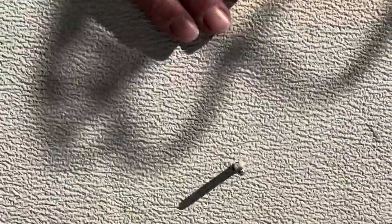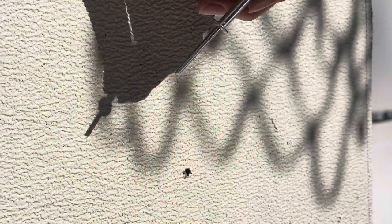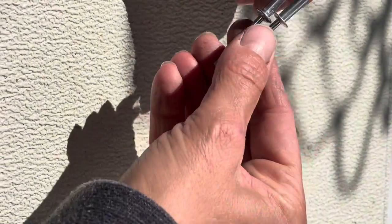You might have one that's too skinny — try it, way too skinny. You need it to just fit in there tightly and securely. Now I know I have the right thickness. Turn it around — sticking out way too far. Remember, one and a half times the diameter should be what's sticking out. So I have way too much and need one the same size but shorter.